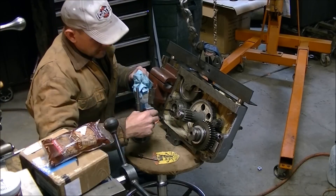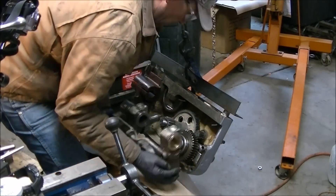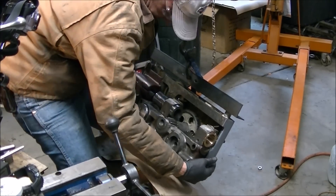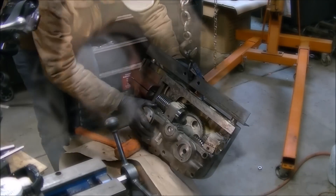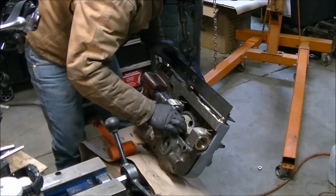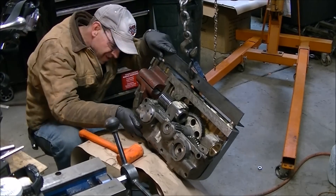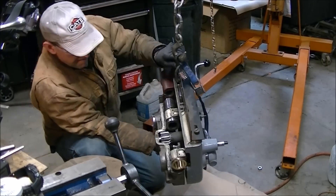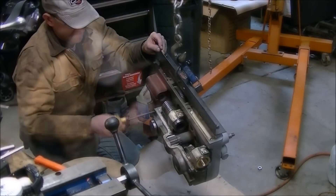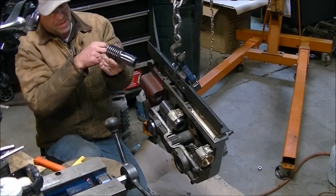I make it look like things went together easily, but there was a lot of fiddling and a lot of things I put together and took apart because I put them in the wrong order. A little patience, paying attention to what's binding where, and don't start beating on things until you're confident everything is where it belongs. There are some dowel pins that align things — it's a pretty tight fit, and a little whacking with the dead blow took care of it. The allen screws that hold the back half of the apron on are different lengths, so there was some trial and error to get the right bolts in the right holes.